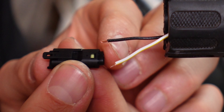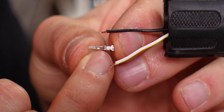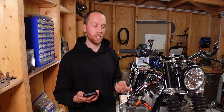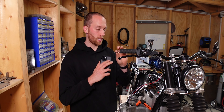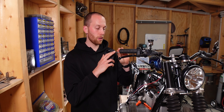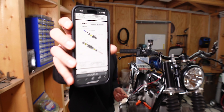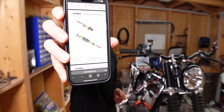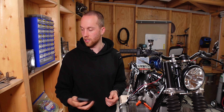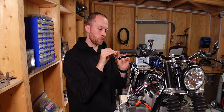For the handlebar side of the connection I use the longer part of the plug, which takes the male crimp connectors — and here is that little slot opening I mentioned. When crimping, pay attention to the orientation of the crimp connector because that determines the orientation of the plug. I want the little clip facing upwards, so we need to crimp the terminals on the right way. I'll link the official Molex P25 manual in the description below — it explains step by step how the plugs go together and how to de-pin them.